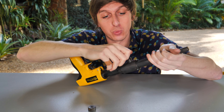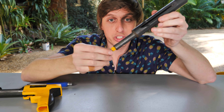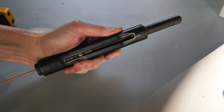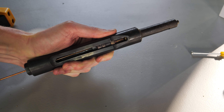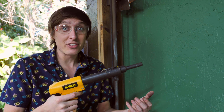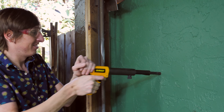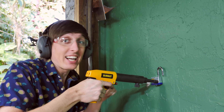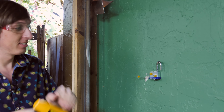Let me show you how this nail gun works on the inside of it. So when you load a nail into it and then you put a .22 caliber blank in the other end, when you set off the .22 caliber blank it pushes on this piston here and it drives the nail into literally whatever you want it to. This can drive a nail straight into concrete, into a lock. It can even nail a lock to the wall.